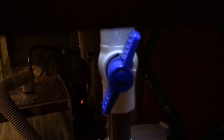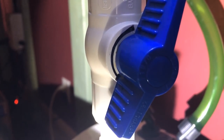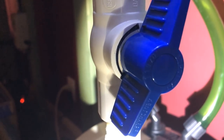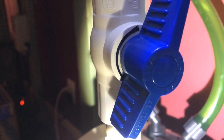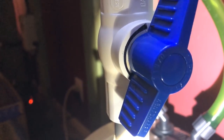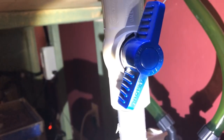Once I was able to match up the proper amount of water I want coming through, I marked — you can see there — there's a marker that marks where the valve should be, and that is something you should definitely do. Mark that section so that you know how much water should be going through the pipe. Once you've got it dialed in, mark it so there's no guesswork in the future. I have it marked on both sides, so there's no guesswork as to where that valve needs to be and you don't end up running more water into your sump than your pump can handle.